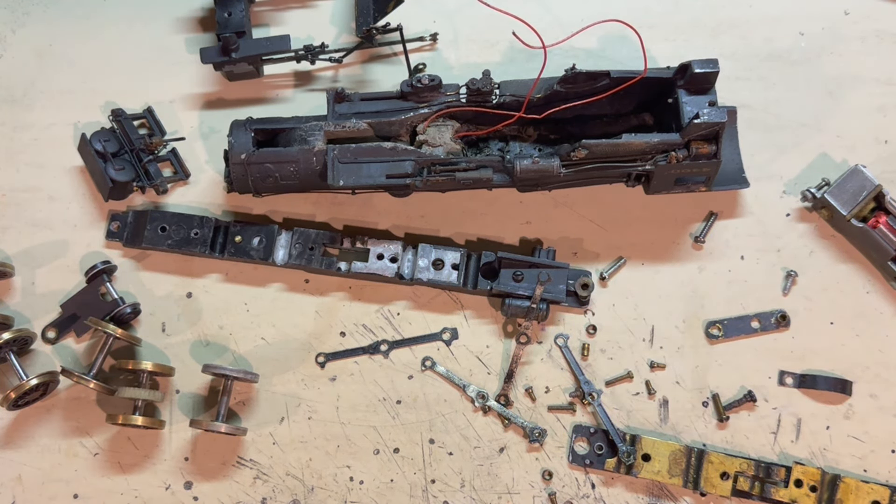It's working just fine. Kind of hard to keep a clip attached to a motor brush like that. That's a really good running motor. It's not the highest torque, but there are no problems at all with it. The lower torque just comes from it being a smaller variety of Pittman-style motor, so not quite as much magnet there. But it does at least have its large drive gear to go with the diameter of the wheels. The gear is almost as large as the wheels, so that should still give it plenty of torque. I think this will drive it just fine.